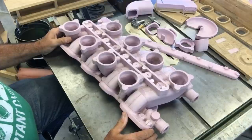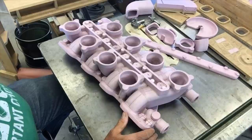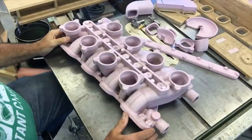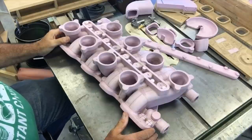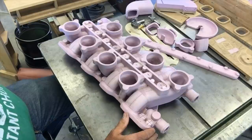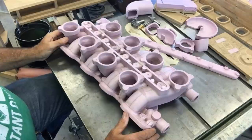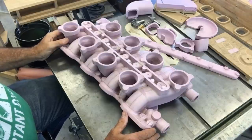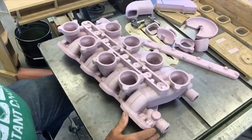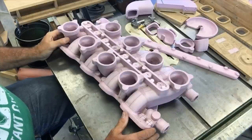So this is going to be at least a 35-pound pour. To do that I needed to make some special handling equipment, because I'll have to use my A60 crucible — that's the next biggest crucible I have above A20 — and by the time I put the shank and the metal and everything else, it's probably going to be about 120–130 pounds to handle. There was a time when I might have thought about slinging that around, but I'm making myself a piece of lifting equipment to do that.